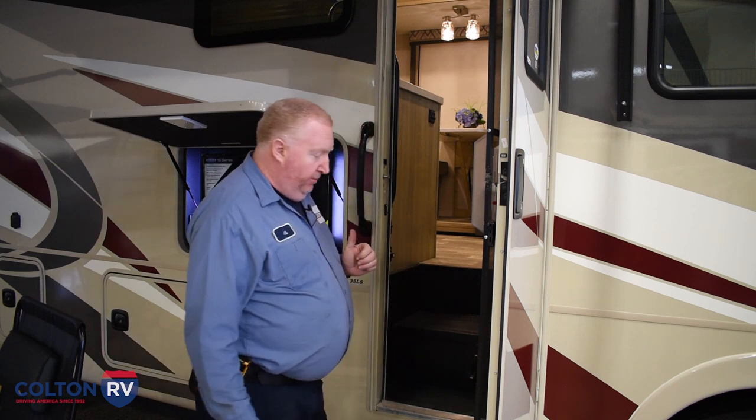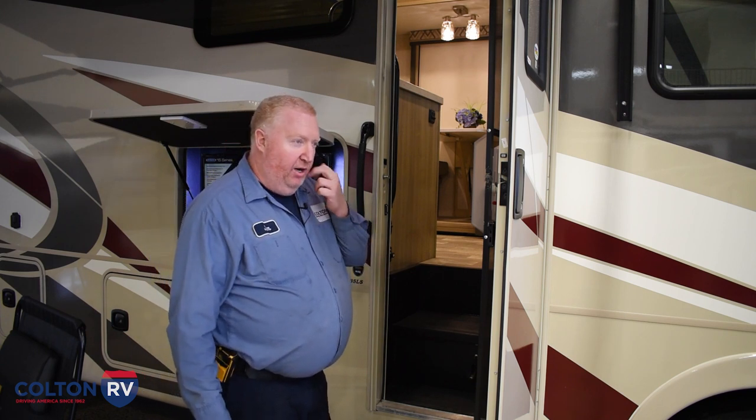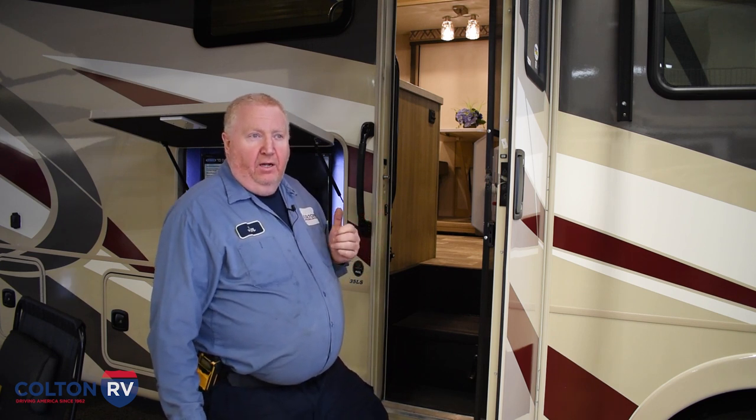On this particular model there's an inverter, so they needed a longer life span for the battery — it'll run longer so that you can have longer periods of time without recharging. If you want to go out somewhere and only run your generator during the day, the battery bank will be enough to keep you through the night so you can watch TV for a while, have your lights on, have your refrigerator hold for the night. Then tomorrow morning you're going to get up and run the generator for several hours to charge the batteries back up for the next night, if you want to do the boondocking as they're calling it.